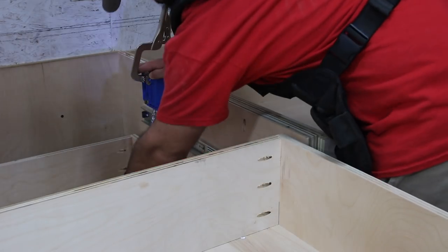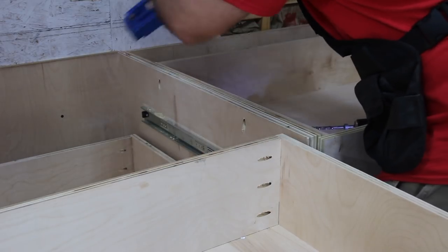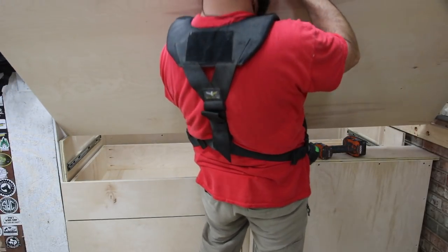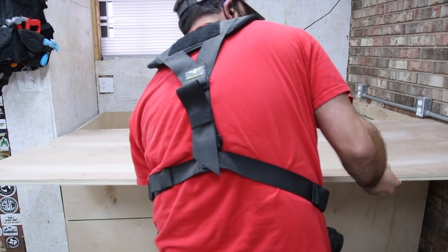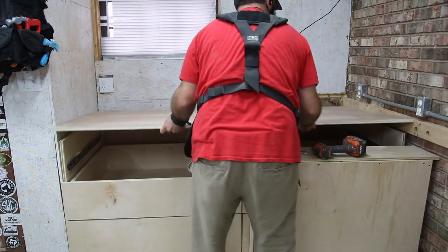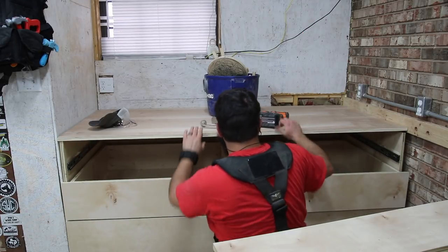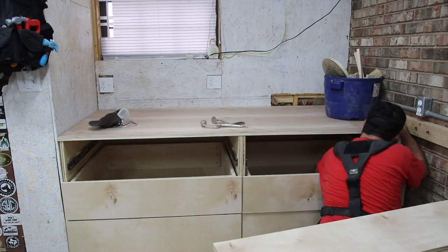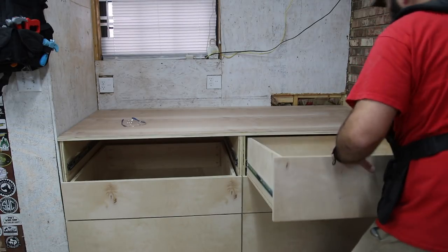To install the top I needed to go back and add a few more pocket holes — I failed to do this before everything was put together, but it can be done at this stage. I wanted the pocket holes underneath instead of visible screws from the top. These are two lower units; the plan is one lower and one upper, but I have two lowers and wanted a solid combined top instead of two individual ones. Now I can secure the top with pocket holes and install the drawers back in place.